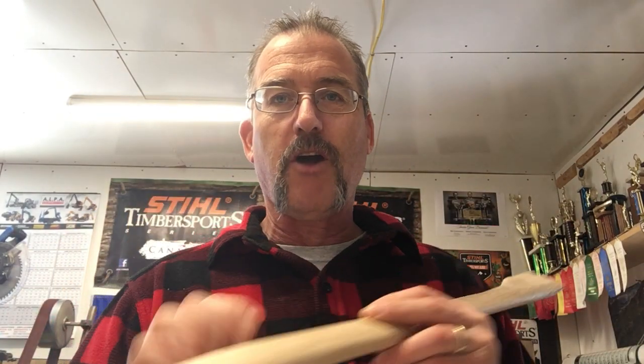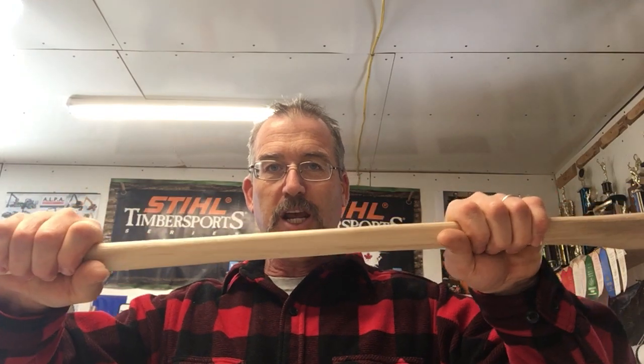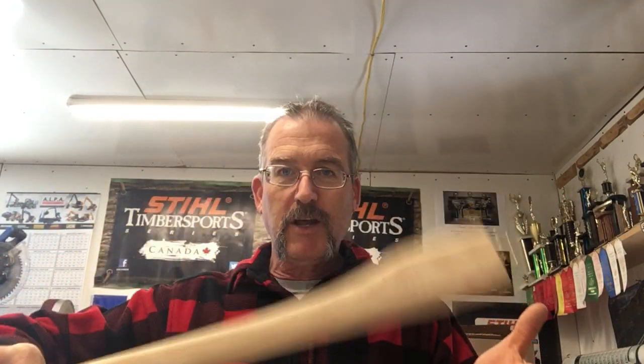What a great opportunity right here in my backyard to do the ultimate test on axe handles. So I made axe handles — five handles with the grain stacked lengthwise with the eye, which is what I normally do, versus grain stacked the opposite way, across the eye. I took them into UNB and said I want these tested. They clamped the handle in their machine and applied pressure right where you would typically strike the axe, holding it at the eye, and gradually kept applying pressure until the handle broke.